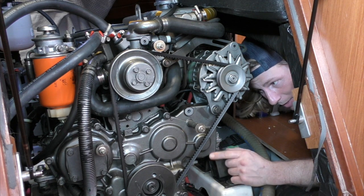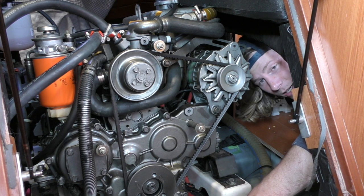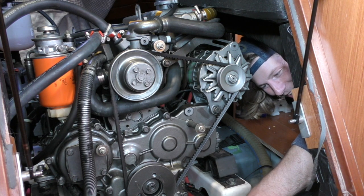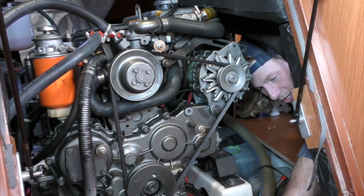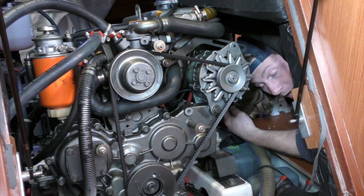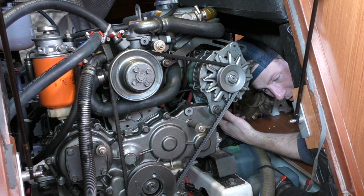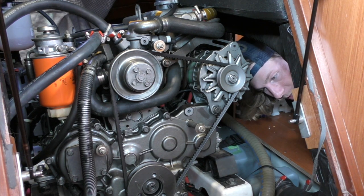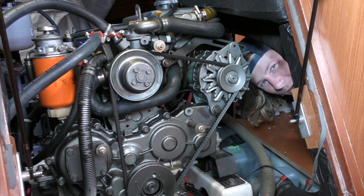So when I ran the engine coolant through when I started it, what were we talking about? Seacock. Yeah. I turned the seacock back open again, and it was closed still. So basically, what I did was I turned the seacock off, and then I just filled up the strainer with water, and then I put the lid on the strainer, so then obviously it creates that vacuum, and then I open the seacock up again. Because if I just open the seacock up and put water in, it'll just keep draining out to water level. Or will the pump be enough to punch it through?